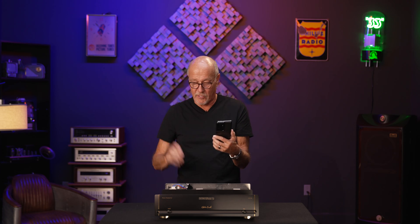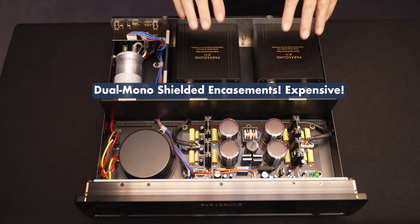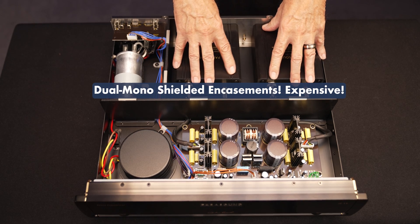Now we're going to get to the controls on the back — how much gain it's got and all that fun stuff. So tell us about these bayonet type plugs. These are the signal paths — left and right channels, all enclosed. The signal does not leave the boxes. The signal goes in from the rear panel and exits, so those cables connected to these boxes are only the power supply and control cables — the signal never leaves it. This allows a very short signal path and great noise performance because you have another layer of shielding within this already enclosed area.